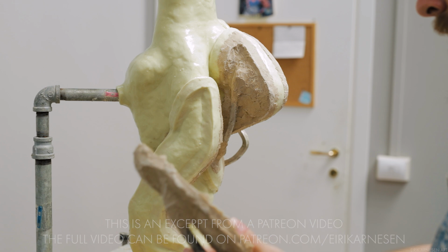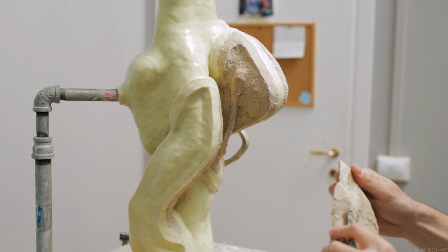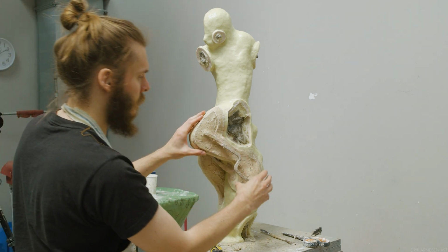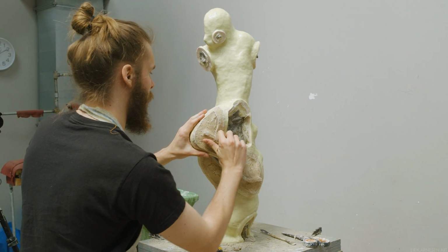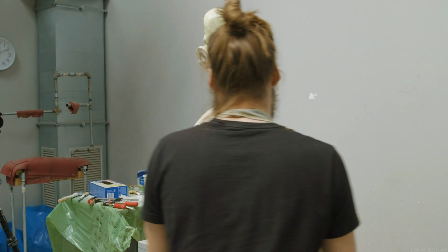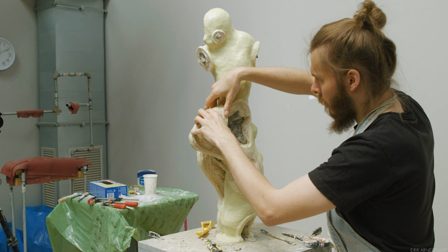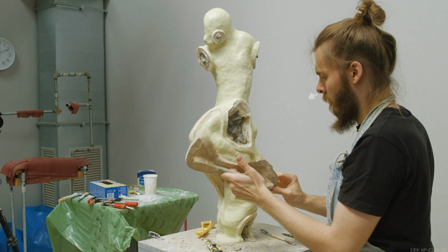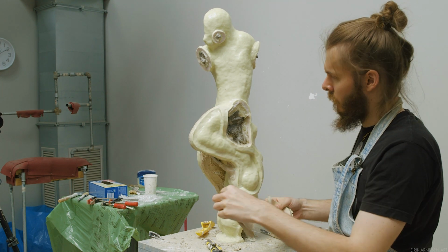It's a very straightforward process if the design of the mold was properly done. If it was, the model mold pieces should just pop off, more or less. I'll take a few seconds to clean up the edges of the model mold before moving on. Sharp resin along the edges of the model mold can hurt both you and the silicone.